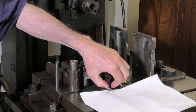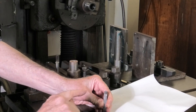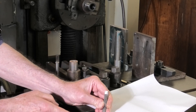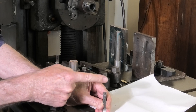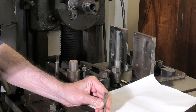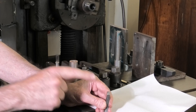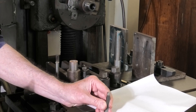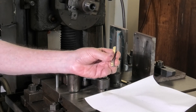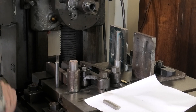This is the little finishing tool that I had on the shaper. You might be able to see it's got a curved profile — about three or four degrees rake, and it would have 25 degrees swivel on it. Most guys go to about 45 degrees, but I find my shaper just won't feed slow enough to use those true skiving tools. So I've only got about 20 degrees across there. Once you do that, it means it only travels in one direction comfortably — if you try and go back the other way you'll get a real gnarly finish, because you're going against the action of the tool. And this is a double-ender, so once it gets blunt I just swap it over in the tool holder.